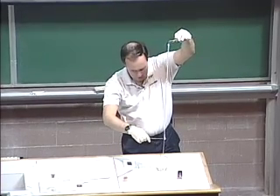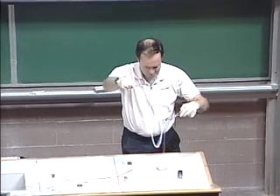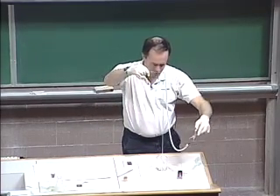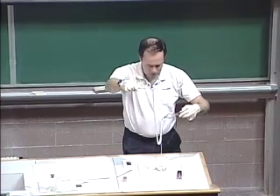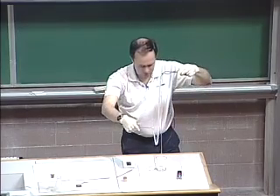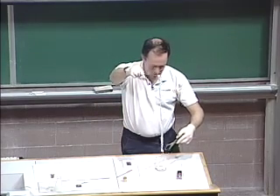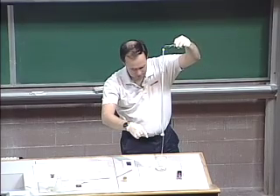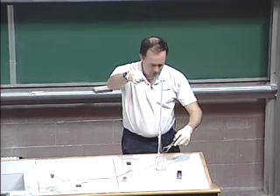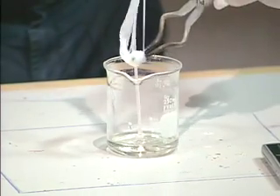So on a large scale, this is done — not with a whole bunch of people doing this, of course. But that would certainly be a minimum wage job, wouldn't it? This stuff comes flying out of a machine as a thread. And it gets washed, because this is actually quite an acidic solution. It gets washed to remove the acid, it gets dried, and then it gets spun into larger collections of fibers. On a large scale, the chemistry is exactly the same — making fibers which are then spun and made into fabrics.